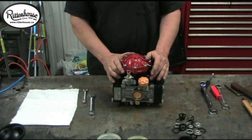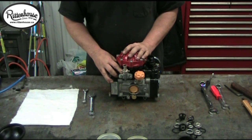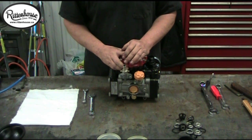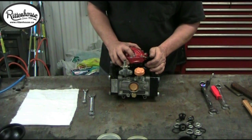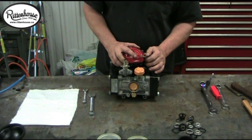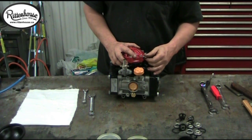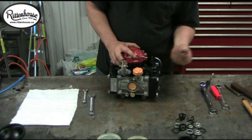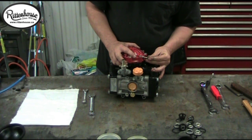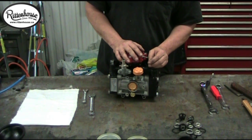After you've got this all remounted and oiled up, you may need to bleed the air off. Fire up your sprayer with no guns, booms, or anything open. Have it run and set your pressure to whatever you're spraying at — whether it be 10, 20, or even 60 pounds. Take a look at the red return line coming off your regulator back to your tank, or any return line regardless of color. If it's bouncing, you need to bleed some air off. Two ways of doing it: take a pen and push on the little nipple, or use the cap and just give it a quick little shot. Once you see the return line and the gauge settle down, you know you have the proper amount of air in the chamber.